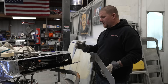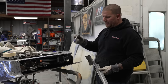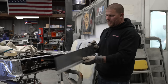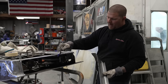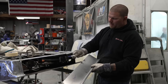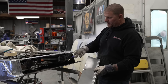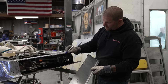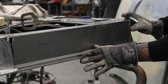Before I get ahead of myself and start welding everything up, it's important to always take a step back and think about some of the other things that we need to make sure we account for. We need to put this piece in so we can make Sharpie marks around these brackets so we can drill the holes in here to capture all of the rosette welds that are going to hold all these brackets. If you have an area like this one that we cannot get to, well, then just put yourself some marks on the upper panel so that way when you put it in, you know approximately